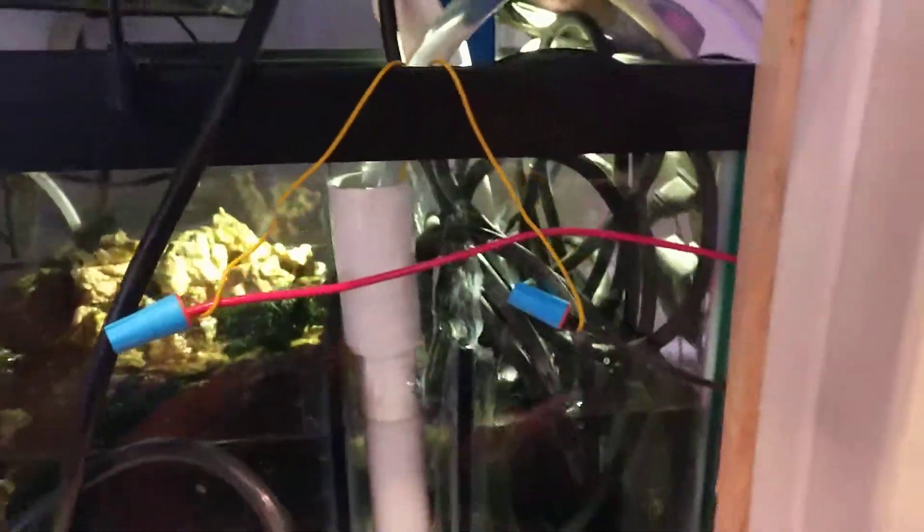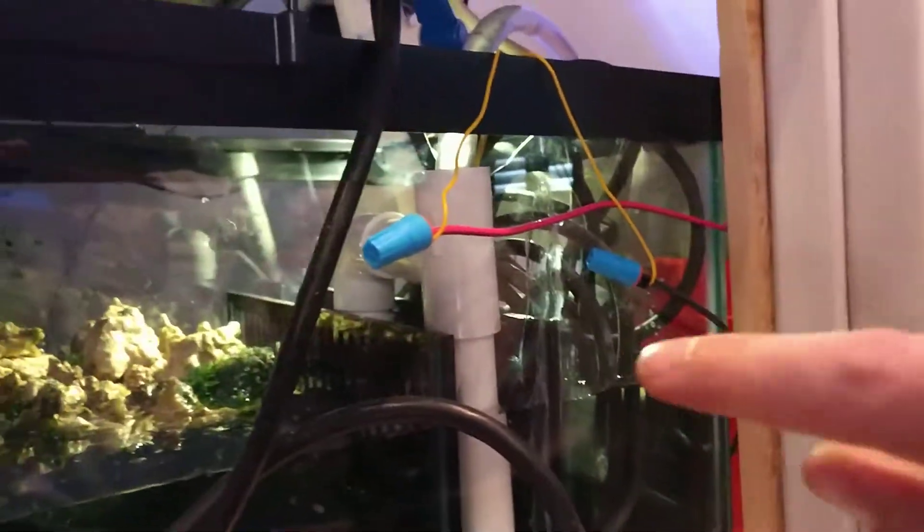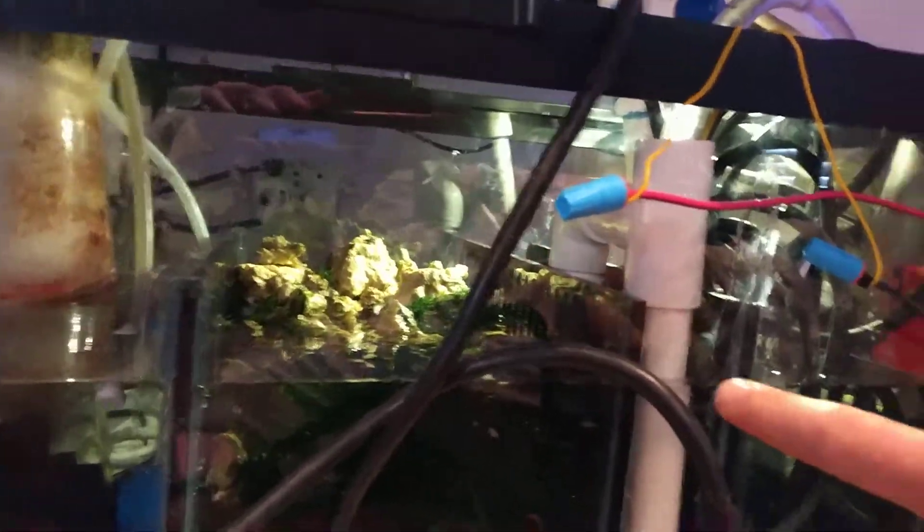With the wiring done into this PVC pipe, the switch you can just see right here. The switch is in the back — it goes right under there. And this allows water to fill. It'll keep filling until it's triggered. It's currently lifted up, so it's done filling right now.